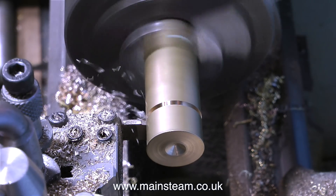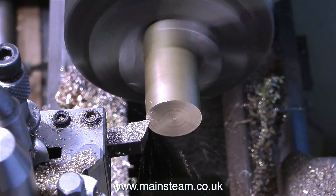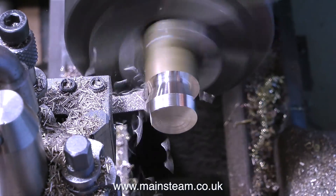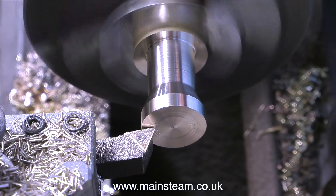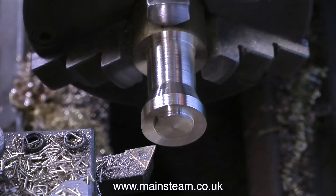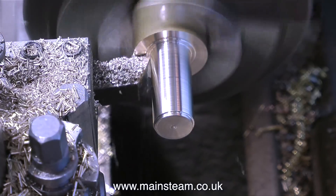I decided to show in this video how not to do it first, followed by how to do it. I put the piece of brass in the chuck, and the first thing I did was part off some of it — it was a bit long and it stuck out of the chuck a long way. I want to show any beginners that if you're turning a piece of metal, you need to leave as much of the metal intact before you finally part it off when you've finished the component, not the other way around. I'm using the micrometer on the square piece of brass to make sure I turn the end of the bar to exactly the same diameter as the brass itself, because I don't want the finished column to be of a larger diameter than the brass block.